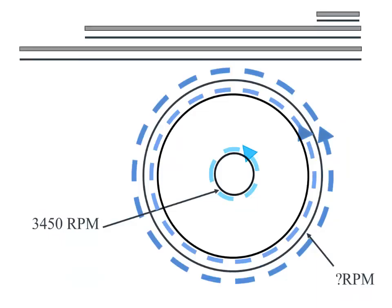The radius of the impeller imparts velocity onto the water. The eye of the impeller spins counterclockwise in a two-pole motor at about 3450 RPM. The impeller's radius directly influences the velocity of the water. The outer radius, which is still spinning at 3450 RPM, must travel at a greater velocity in order to cover the same distance. Further you are from the eye of the impeller, the greater the velocity. You can change the velocity by changing the radius — one way is by trimming the impeller or cutting down this radius, which will lower the velocity and thus lower the energy.